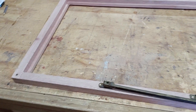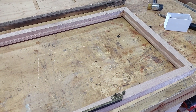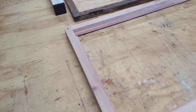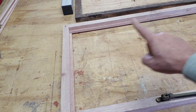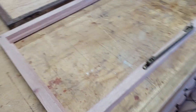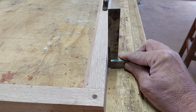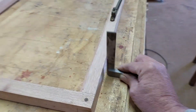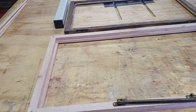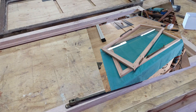The customer will do the varnishing himself and I suppose he will polish and clean them up. My job was just to make the frame. Something else I want to show you that I learned with these window frames: this is the bottom — the hinge part — and it closes like this. Because of wood movement, I've cut a very slight chamfer on the bottom where it closes towards, just to help a little bit once the wood starts swelling and getting wet in the rain if it's not sealed properly. That helps quite a lot. So let me fit the glass and then this is done.